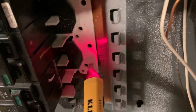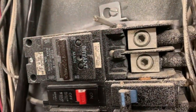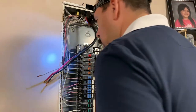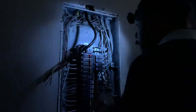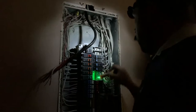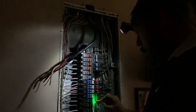I'm at the box now, getting ready to put the breaker in. Before I do, I'm going to test with the tester — there's definitely power because I haven't cut anything off. I'm going to cut off the main breaker. The tester tells me there's power coming to it. After cutting the main power, I test again — this still has power so I need to be careful with it, but the main bus bar has no power, so we're good to proceed.